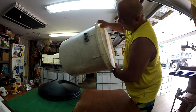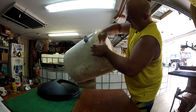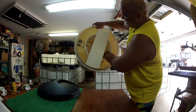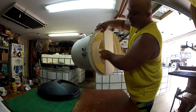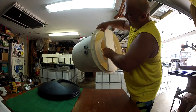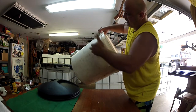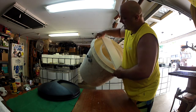From there I have my pail which I drilled holes in. The water is going to come up into this pail, it is going to be collected by these two outlet tubes which are removable, and then spill over into my two outlet fittings and then into my filter and mineralization tank.